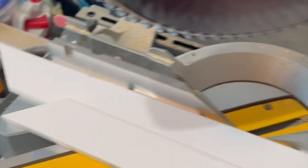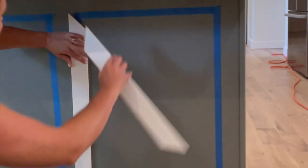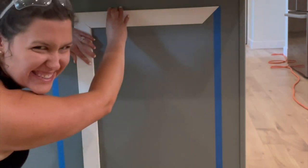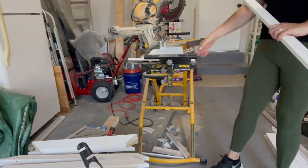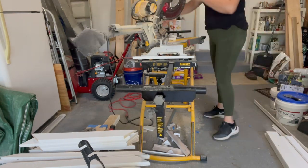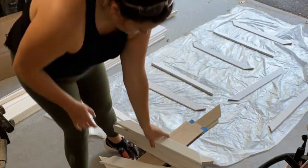The plan was to cut down all of the boards. I cut two boards first just to dry-fit them and make sure they fit, and then I did a batch cut trimming down everything at once. I set the stop block on the saw stand, which allowed me to cut all of the pieces without measuring every one individually. I laid them all out to make sure everything looked good and then it was time for paint.